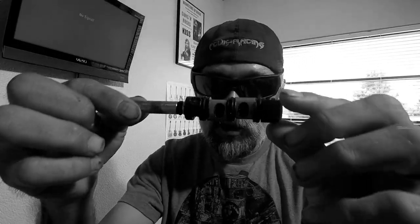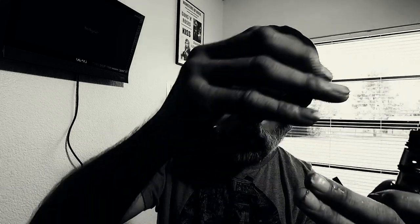Inside of this is a cylindrical bearing. It's round, it's about that long, and it goes up and it goes down. That's why they call this a Posi-Temp. On these Moen single-handled valves, as you turn your water on, it goes from cold to lukewarm to hot and back down as you turn it off. As you turn that knob, that cylindrical bearing will lift and turn and position itself to wherever you have that water demand — whether it's cold, less cold, a little warm, all the way to hot and back. It acts as a cylindrical bearing with multiple little holes, and as you shut it off and it drops back down into the bottom position, it returns to where it started, which is cold.